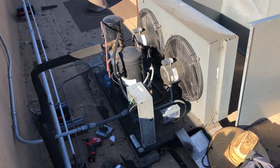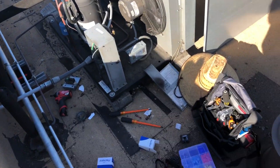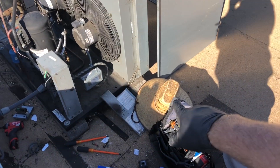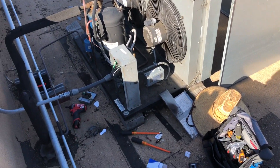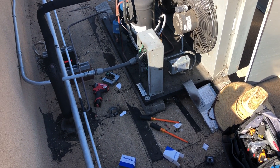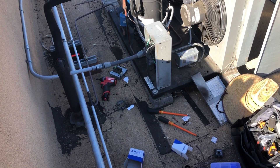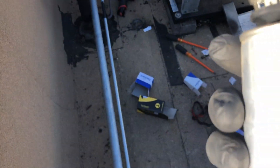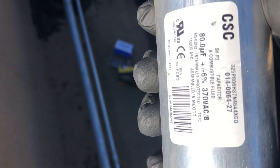Awesome — you can see she's up and running. My little mess down there. I had a little bit of shade so I was able to take my hat off — that was nice. What they had at the little parts place in town was an 80 microfarad run capacitor — they had an 80 by 5. We'll use the 80 part. You can see she's all blown out.